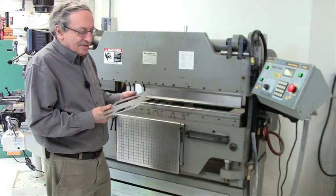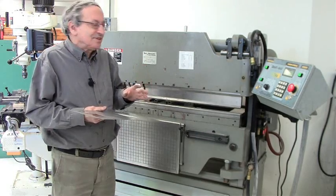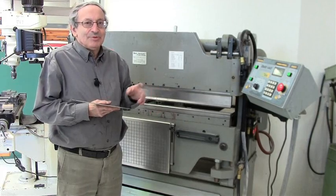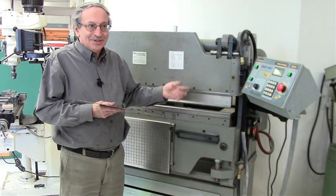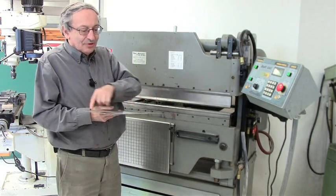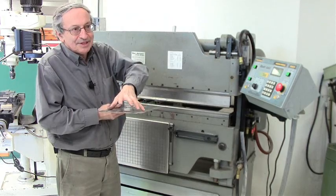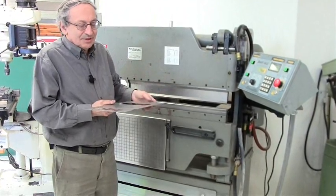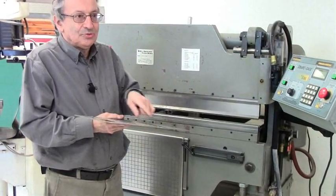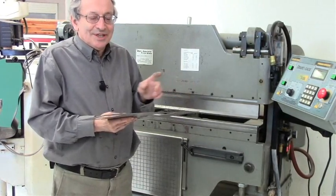The next thing we do is put in the bends. There are two very important things when putting in bends. First, you have to think through the order of bends, because some parts can only be bent in one order — otherwise they jam on the machine. For example, the edges have to be bent up first, and then you make two bends here where the die has to fit between the bent-up edges. If you do it the other way — if you bend these first and get a U — you cannot come in and bend the lips. So you have to look at the part, take a deep breath, and figure out the order of bends.